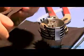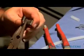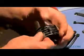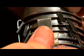The negative plate is very important because we only have one main negative strap which connects to the plate. We bend this so that it's very tight. And in the process of doing this, once we snap this on, the other 2 straps may become loose and will require some more adjustment. This is normal. You may have to do this 4 or 5 times. It can be very frustrating or very enjoyable depending upon how you look at puzzles. You snap this on, snaps right into position, grabs the cup, and voila, you have a fuel cell.